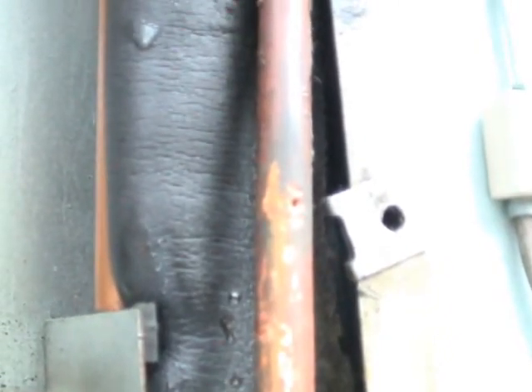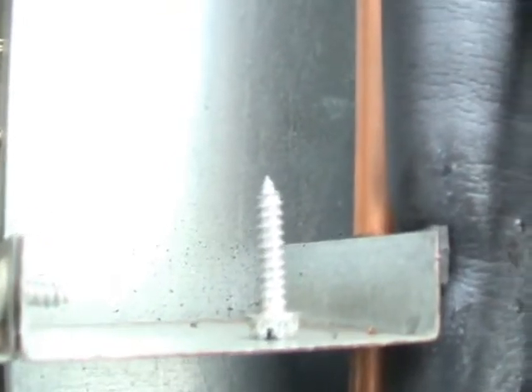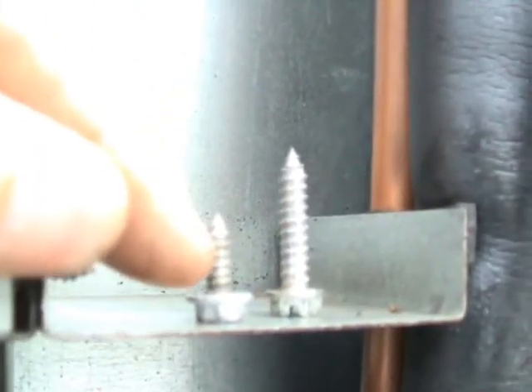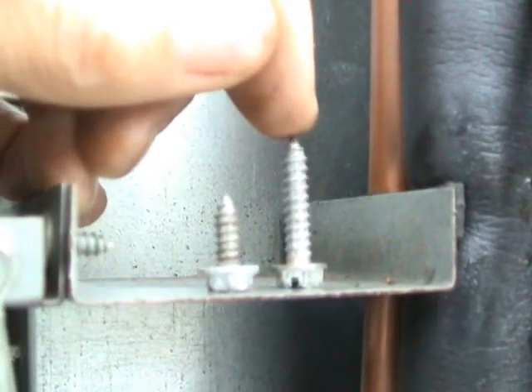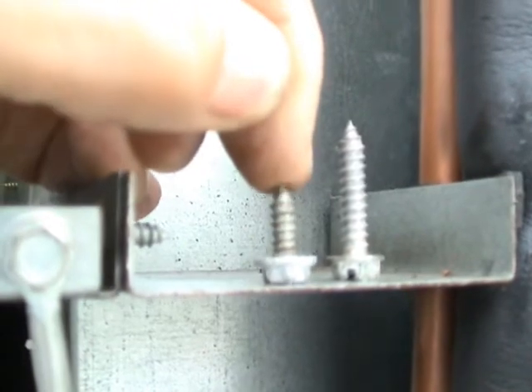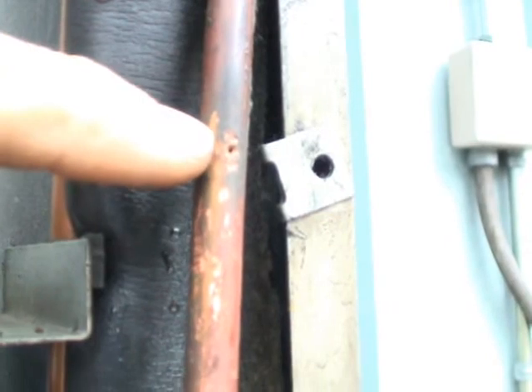Here's a unit that sprung a leak — right here. Can you see that hole in that liquid line? Well, that hole was caused by some filter changers that used screws that were too large. This is the size screw they should have used. I guess they lost the screw or something and just used something really big, but they should have used something about this size. And here's the result — that hole right there.